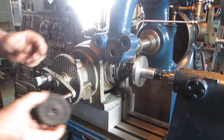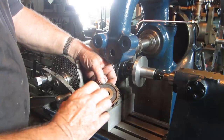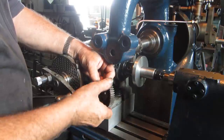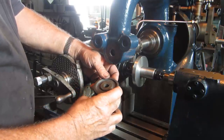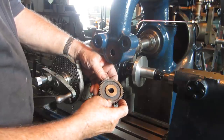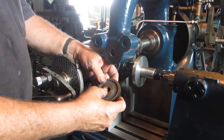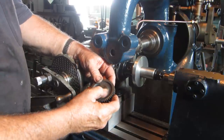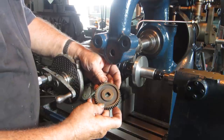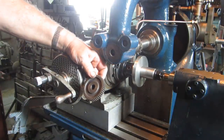We had some lathe gears, so first thing you need to do is figure out what the diametrical pitch of this particular set of gears is. They'll all be the same if they mesh with each other. Now this particular gear happens to be 46 teeth, so there is a wonderful set of formulas when they standardized these gear tooth things years ago.